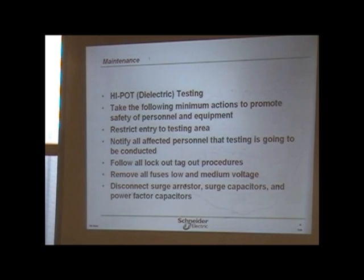These two, and it would be on something like this, because it's going to be feeding a motor control center. And these would be your other loads in your motor control center and everything else. So that's your main to that motor control center. That breaker trips, and you have one of these indications. Maybe you don't have these indications, but regardless, the breaker is tripped. If a breaker is tripped and you don't know why it tripped, because you don't have any kind of indications, you do want to definitely isolate your loads before you try to close that breaker.